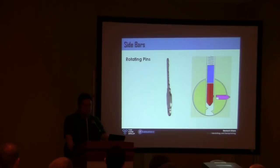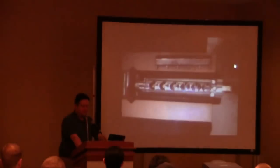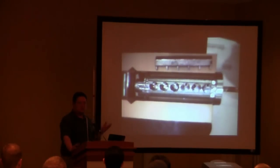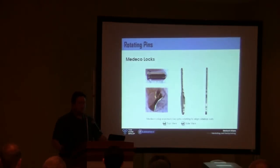Medeco is a very popular lock — if you do any work in the government space, you've probably seen Medeco locks. It's a sidebar-based lock where the sidebar actually interacts directly with the bottom pin. The key pin spins into position, allowing fingers on the sidebar to fall inward. The sidebar notch in the key pins is aligned because of these chisel tips, and the actual bitting cuts on a Medeco key are in different directions. I took a Medeco lock apart and shot some video of the plug — you can see these little dark spots, the actual channels where the sidebar fingers fall in. As you pull the key out, it randomizes and flips all around. It's a really neat design. Unfortunately, this design has not really changed in the past few decades — they were able to coast on it and never really evolved it except for some cosmetic changes to extend the life of their patents and copyrights.